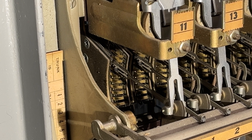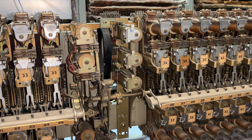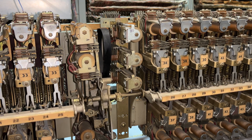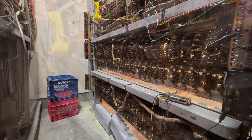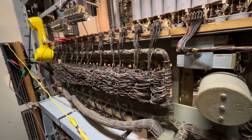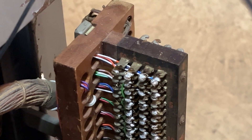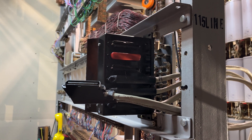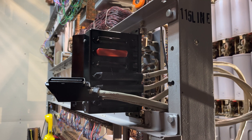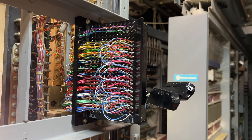I will show the master switch operating and the rear of the rotary line switch. This is the terminal block on one of the rotary switches; that cable goes to another block that has the outlets to the selectors. This is the bunch block where all of the outlets are tied together. The touch-tone converters will be plugged in where the red cover is, and the outlets of the AE selectors will be at the very top of the block — that has yet to be wired. The wire side of the connecting block I'm using is my bunch block.